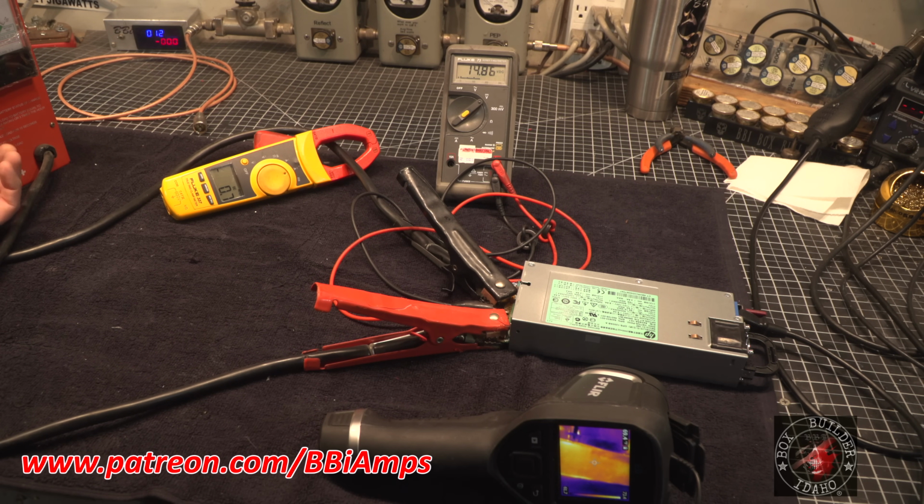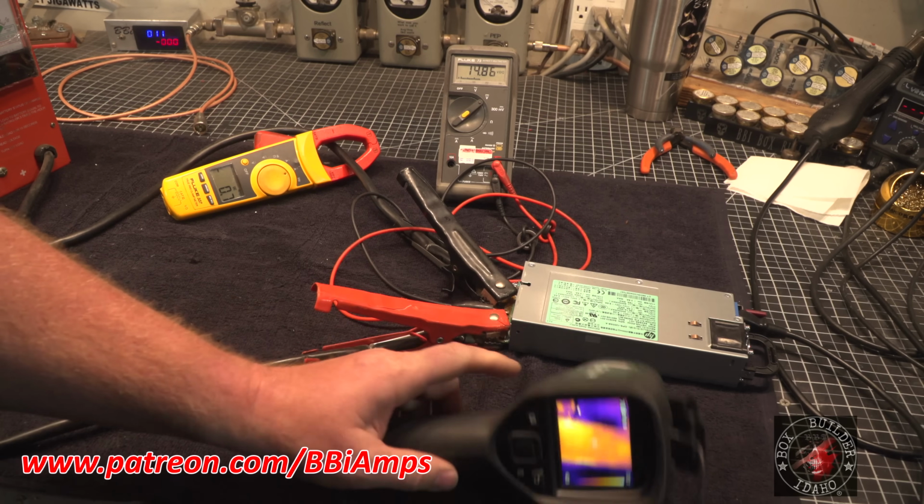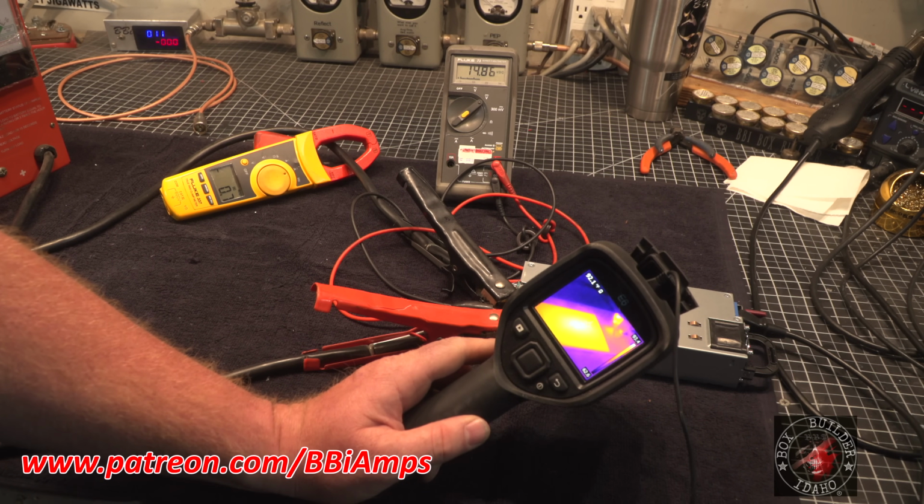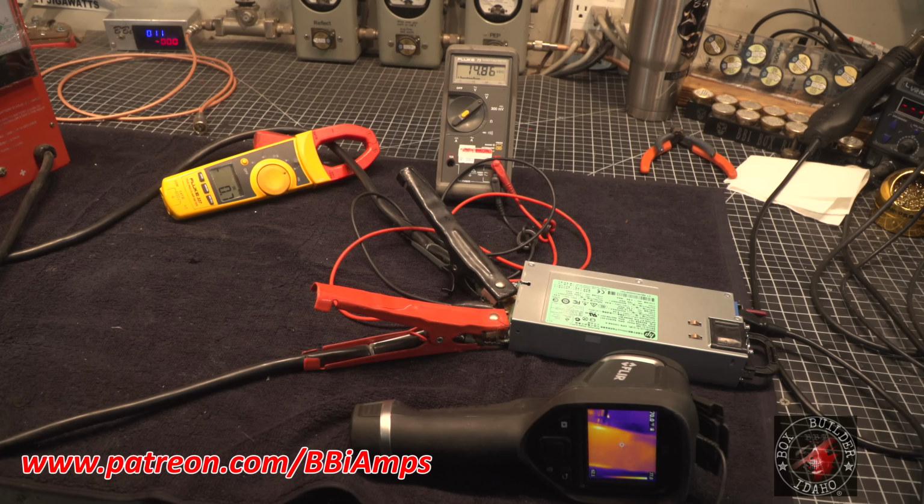So now we'll pull all the load completely out of the pile. And now we're going to let the pile cool down, because the pile's now at a couple hundred degrees. Our carbon pile. And I'll let this come back down. So we're already down to 92. So let's go ahead and raw dog it, or put a significant current load on the device, and crowbar. What did I tell you? This pile is old. The plates aren't smooth and linear no more.